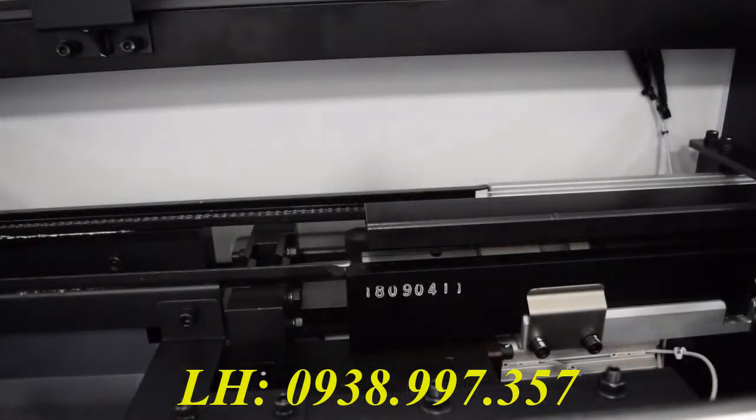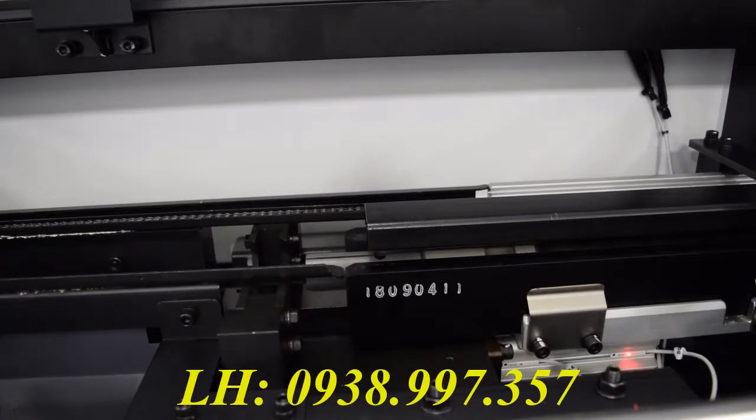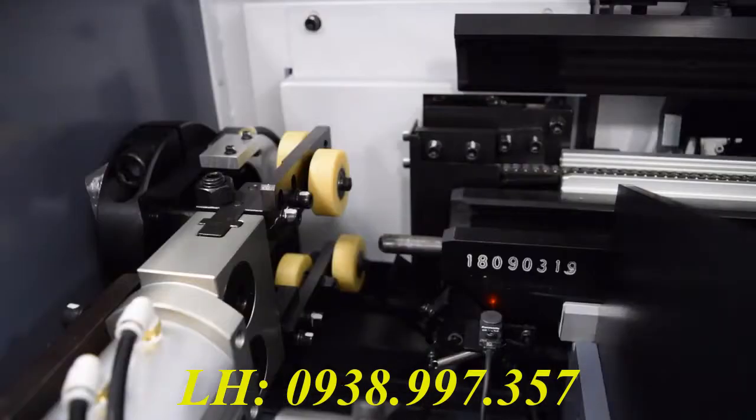At this point, you can load a bar into the bar feeder collet. Once it starts moving forward though, you want to be cautious not to go too far. I usually go just past the rollers like shown here.